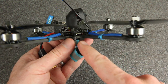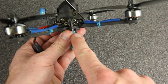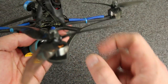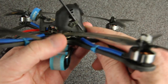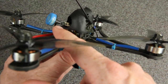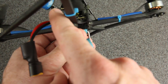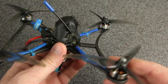Back to the canopy — it's mounted with a little nylon standoff and an M2 screw going to a steel M2 bolt, and that's the main support on the two sides. In front there's no bolt on top; instead a screw goes through the frame into the plastic of the canopy. The canopy is only anchored on three points — there's no screw in the back, which could be a durability concern. You could add a screw and standoff in the back, but you'd have to drill it out a little bit for an M2 screw.